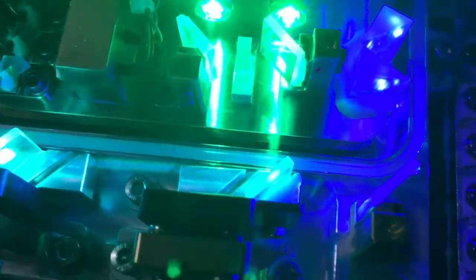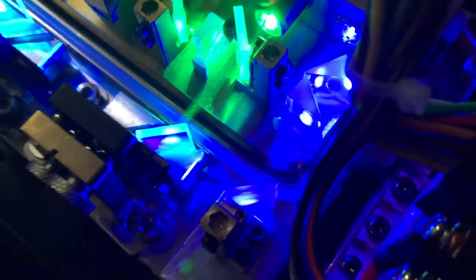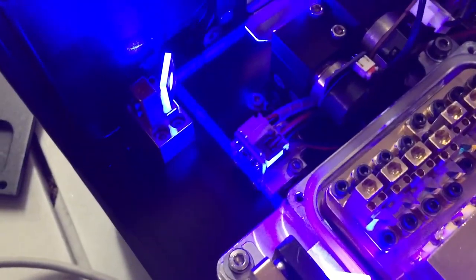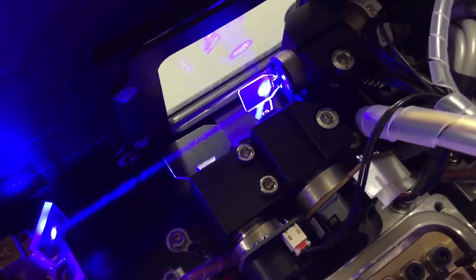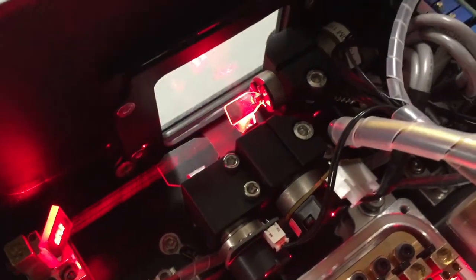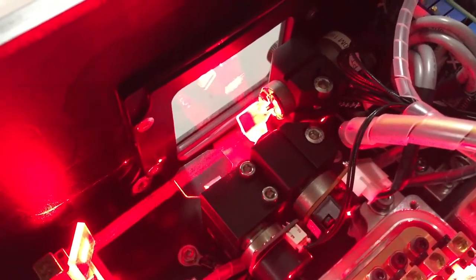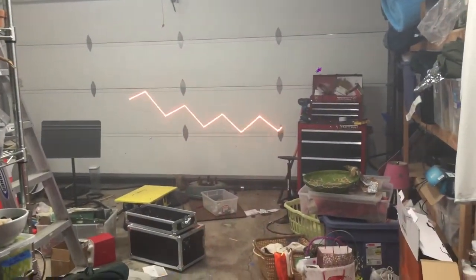You can see that dichroic glass I was talking about earlier - the dichroic glass combining the blue and green channel together there. Basically, these are all just combined down and then sent with one more bounce mirror to the galvos here - the galvanometers. You can think of them as essentially really accurate motors, and they're actually the way that all the laser images are scanned. The bottom mirror is the x-axis and the top is the y.